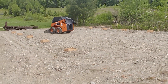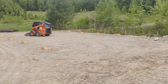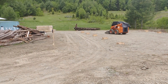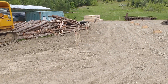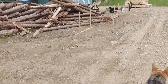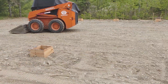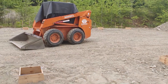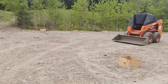Another thing I like to do is the batter board layout. These batter boards are grade stakes pounded into the ground, and it's important that you put them outside of your working area — 10 or 12 feet — so you can get your equipment around there. You then connect them with a horizontal grade stake, and using your laser transit, if you can get all of those level about four inches above your finished grade, you can use a carpenter's speed square to make sure all your corners are lined up. You just move a screw, square your building, and drop the lines out of the way when it comes time to work.